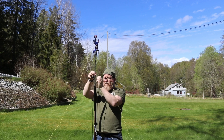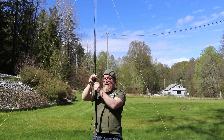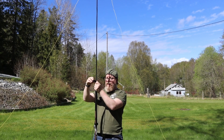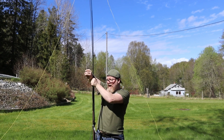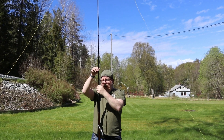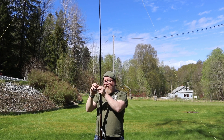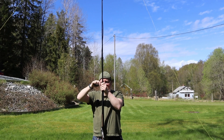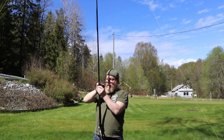The mast is also a Ham Radio Dude mast — the Little Dude Six, a six-meter mast. I love it: it collapses really small, it's lightweight, and it's still relatively stiff. It's a six-meter carbon fiber mast. Some hams say you can't run a vertical on it — I usually haven't had issues running a vertical on carbon fiber, but just be aware that carbon fiber is a conductive material.